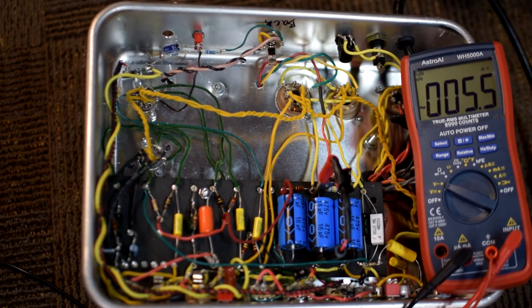Maybe you've taken voltage in an amp 100 times and you've never had a filter cap store anything at that point. But then maybe that one time it fails and you have a problem, and I think that's just as dangerous as anything else. So make sure you're keeping on your guard. So those are all my tips.